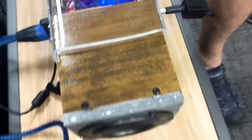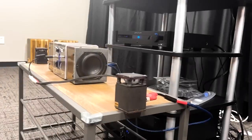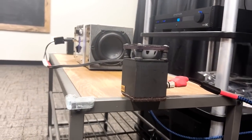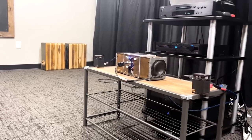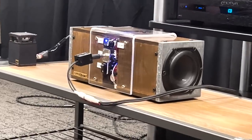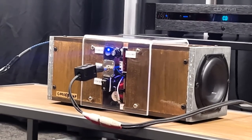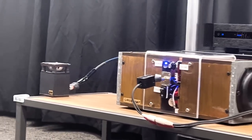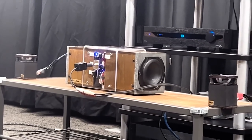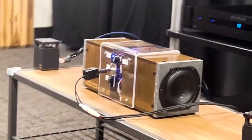The two-inch cabinets cost me a dollar each at Dollar Tree, and the woofer cabinets were five dollars each at Jo-Ann's — pre-finished. About $160 worth of drivers total, stuff I had on hand. With bandpass designs you can tune alignment and bandwidth — you can get more output for a driver with lower sensitivity, or go broader output range with lower sensitivity. F3s are 55 and 80 Hz, and in a room you get some loading so they play a bit deeper.